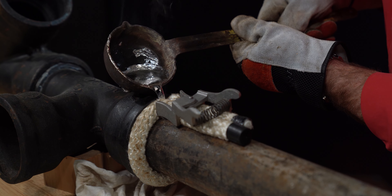Hey everyone, I'm Hubba Hubba Hawk Starlight and I'm here to talk about hub and spigot joints. They're fantastic for connecting cast iron pipes and they're super durable. You just need to slide the spigot into the hub and seal it up with some groovy oakum and molten lead. But remember dudes, this method is a bit old school so you might not see as much of it in modern plumbing. I think it's because those new plumbers don't know how to use the torch, the pot, the lead — they don't know what they're doing. And brazing? With hair like this, I don't want to be around a torch. I want to be something I can stay away from and be in control of.